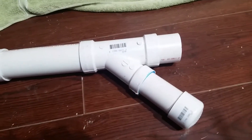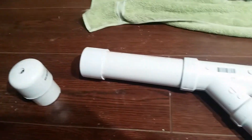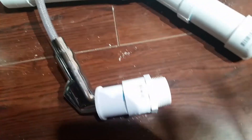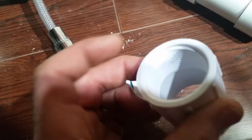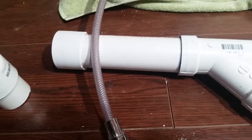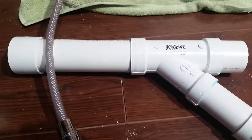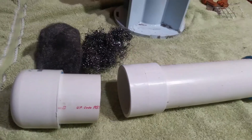I took more two-inch PVC, cut it, glued this piece on there, drilled the hole out which is where it'll spit the foam out. The end of this wand is going to have a threaded piece that goes into a threaded PVC fitting, and those two things go into the end of this gun — that's where the solution mixture and air will flow through, go into this gun, and shoot out. Inside this chamber we're going to stuff it with some stainless steel SOS pads. I apologize for not videoing making the handle; we'll go from here and put these pieces together as I've designed.